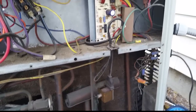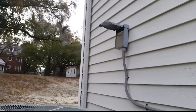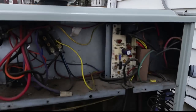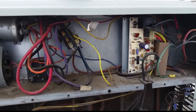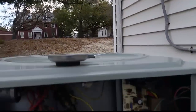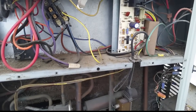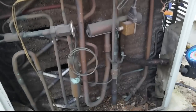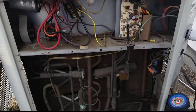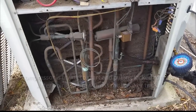So we might go back to the fact that the breaker might be the faulty part. What I'm gonna do is pull the disconnect out, because we have no power since the breaker tripped, and see if the breaker trips with the disconnect pulled out - meaning there's no flow of electricity to the unit. I went back up and reset the breaker. Our compressor is not running.